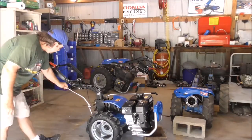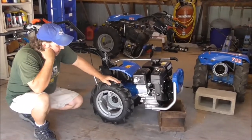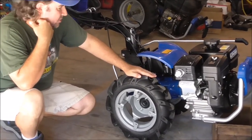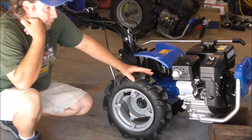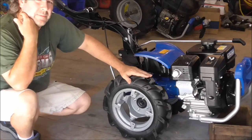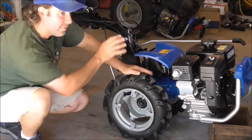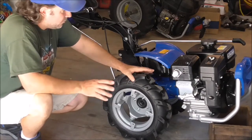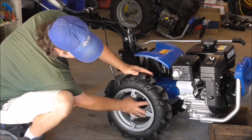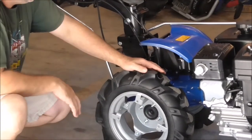Let's take a look at the wheels. We can put on all kinds of different size and style tires — steel wheels, a wide variety. These are 4 by 10 by 18 inches tall, much taller than just about any American-type tiller out there. On the bigger size tractors, the 732 with its bigger stock engine comes with the next size up, which is 5 by 10 by 20 inch tall. These are adjustable rims — we can move these wheels out if we want, giving a little more stability and balance, or if we were running the rotary plow to get a wider width. You can essentially unbolt your inner rim, and it can be flipped two ways to bolt onto the inner set of brackets or the outer set. That's how you adjust your wheels out.